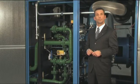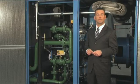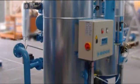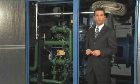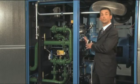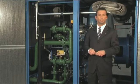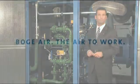The overall efficiency of the screw compressor can also be increased by the use of an HOC dryer, which generates dry compressed air down to a dew point of minus 30 or 40 degrees Celsius with no additional use of energy. Additionally, heat recovery can be used with this compressor to use the heat generated by this compressor to save energy at another side of the production plant. This gives best energy efficiency of the whole compressed air system.